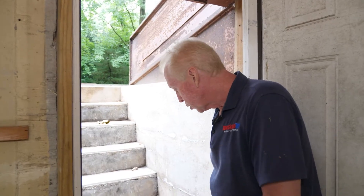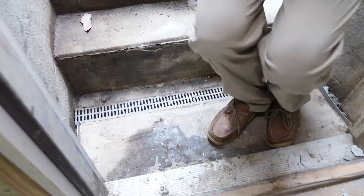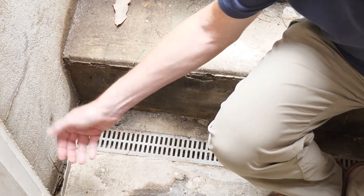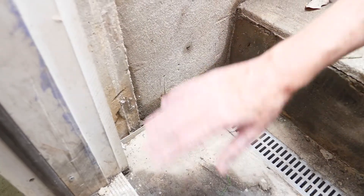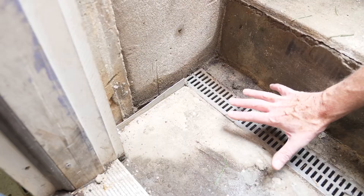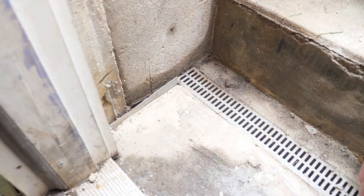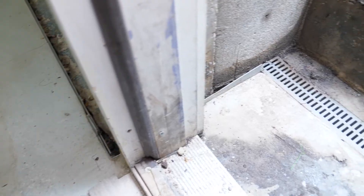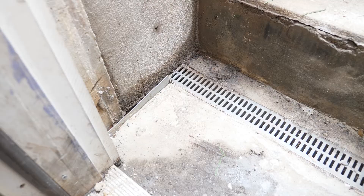We have a drain across here that's very, very small. If you look, it just goes to here, and then somehow has to fill up high enough to get into where that gutter system is. This thing just fills up with water until it overflows into the drainage system inside the house — very ineffective and pretty close to useless because of the nature of the drainage, the size of the drainage, and most importantly where that drainage is placed. It's all way up within the depth of the floor, so you just can't get enough of a pitch to get this water over to the pump.